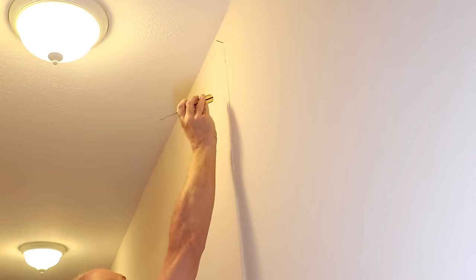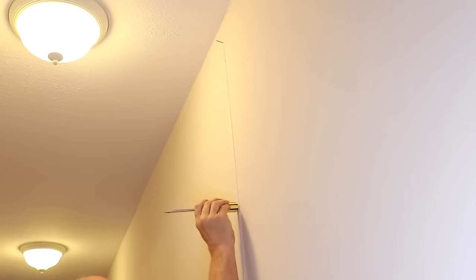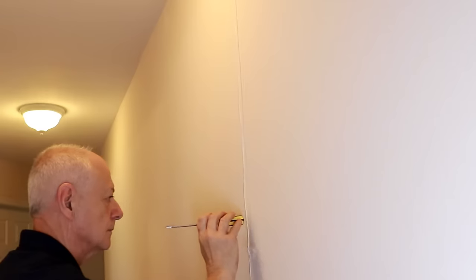Next, start tapping on the wall over the string with the back of a screwdriver and listen for different sounds. Dry wood termites make hollow spaces where the galleries are, creating a different sound than areas where the 2x4 is solid. When you tap on a hollow space in the wall stud, it will have a slightly different sound than a stud that has not been hollowed out. If the gallery is small enough, you may not hear any difference in sound at all, and there may be too little frass to hear falling — yet there could still be a gallery there.